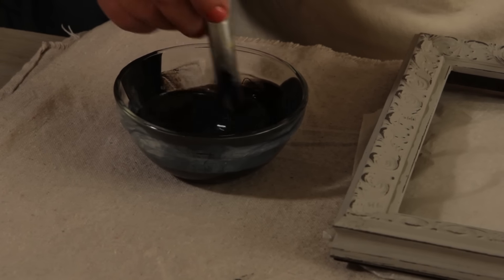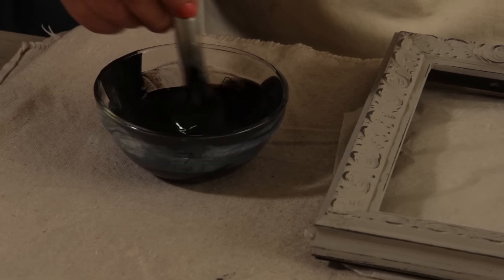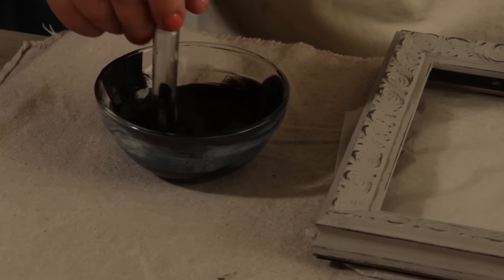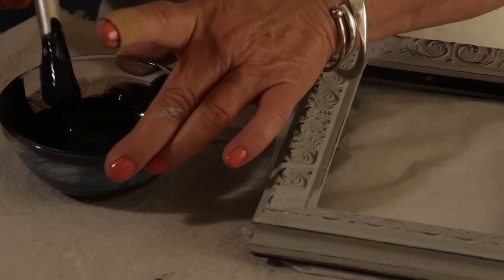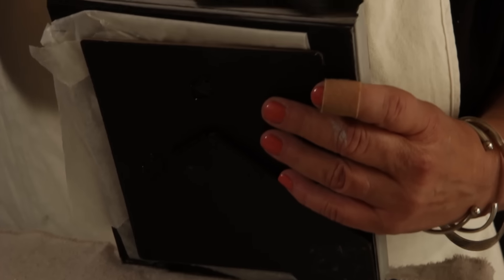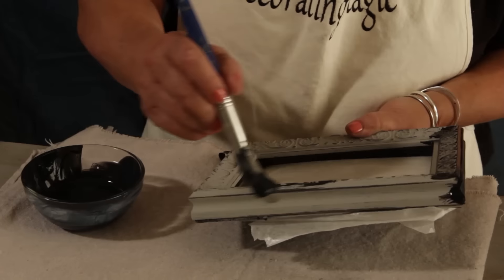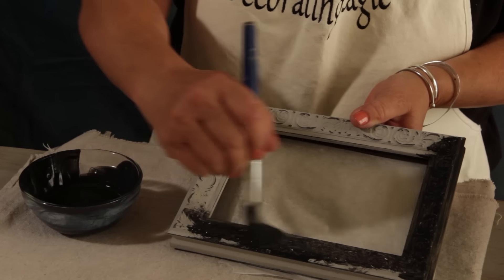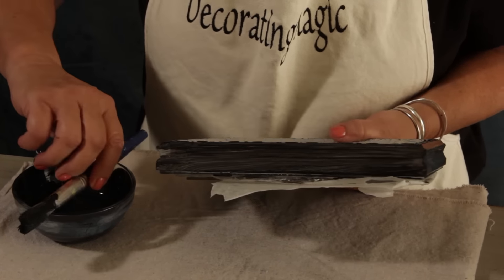I'm using an antique glaze that I made myself — it's one part color (I use burnt umber acrylic craft paint from the craft store) and three parts glazing medium, just mixed together. I'm using the same natural bristle artist brush. I'm going to apply it liberally all over the frame and then wipe most of it off. It looks very dark going on. I'm getting it down into those nooks and crannies. The glaze doesn't change the color of the paint, just the translucency. The glazing medium gives you a little time to play with, so I take a clean rag — I usually use t-shirt material.